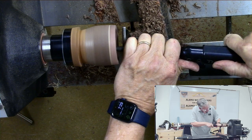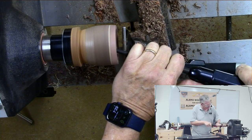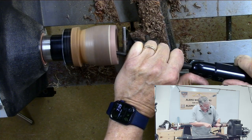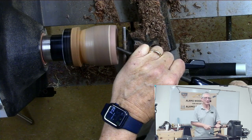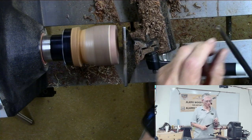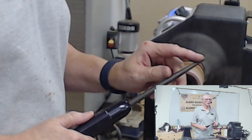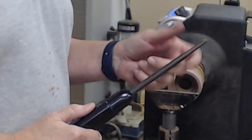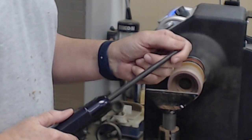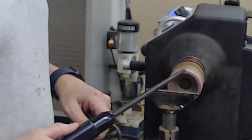The Hunter tool cuts best when presented at a 7 o'clock angle. I'm using a Thompson handle which has flat sides. If I put my thumb on the engraved part, I know the cutter is properly aligned. I talked to the folks at the Hunter booth at SWAT last year, and they recommended rotating the cutter every time you use the tool to keep it sharp.